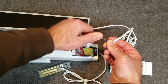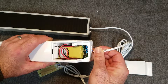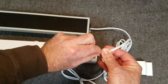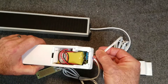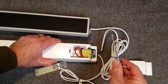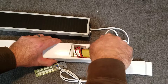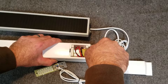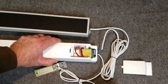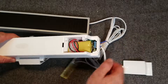I'll go ahead and make sure I've got a good twist on the wires. Insert them both. With the screwdriver provided, re-tighten them down. You don't want to over-tighten — all we're doing is clamping a little tab. Give the wire a tug. Now they're in there secure — you can hang the solar panel or the operator from those wires. A good solid connection.